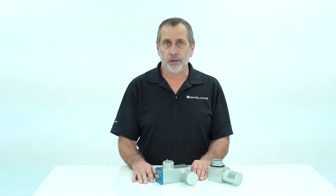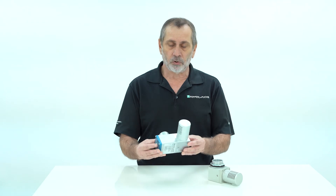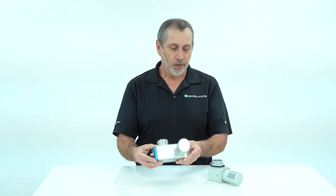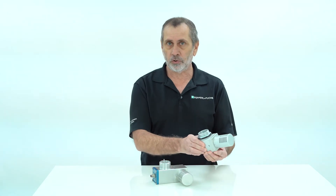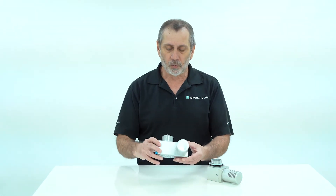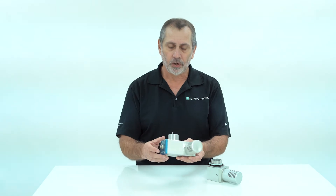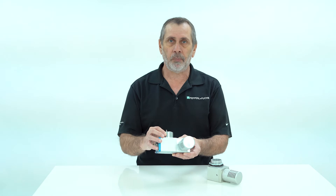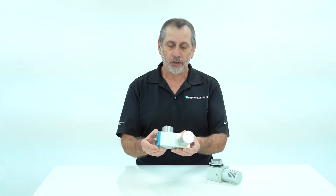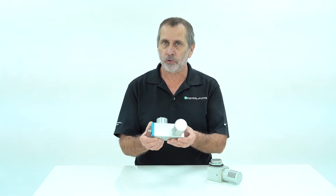Here at Pepperl+Fuchs we designed these two styles of vents for pressure relief. This particular one is a Zone 1 / Division 1 Type X purge vent, and this one is a Z-purge Division 2 or Zone 2 pressure relief vent. The Division 1 unit is bigger because it contains a pressure sensor and a flow sensor inside the device that are intrinsically safe. It communicates pressure and flow through this vent back to the 6000 or 6500 control unit via an intrinsically safe line — as required by IECEx and ATEX certification, which require measuring flow at the exhaust.